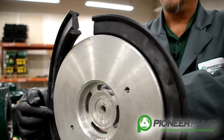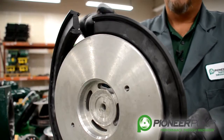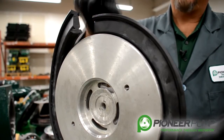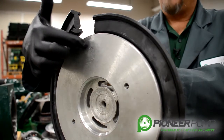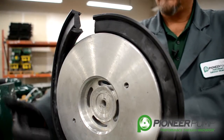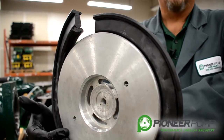If you do not follow that procedure — if you were to start in one place and work your way around — the seal would bubble out to the outside and you would never get it put in. Follow this suggestion and use a vise; it makes it a lot easier to hold the actuator as you're putting the seal on.